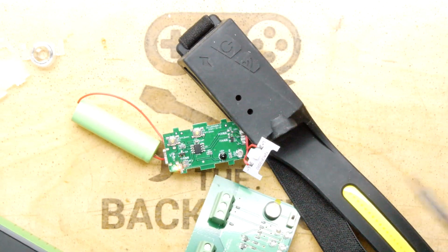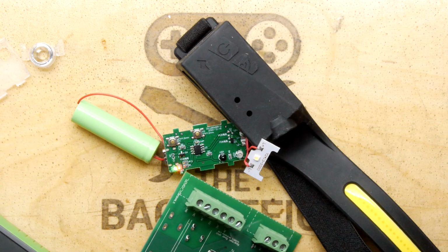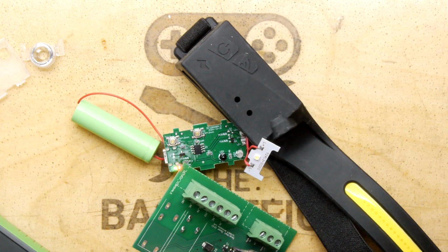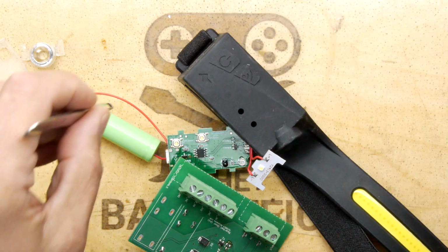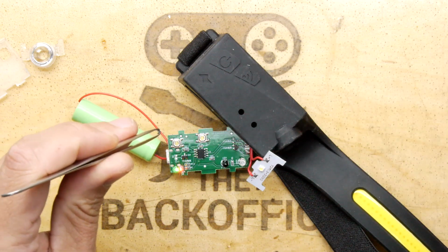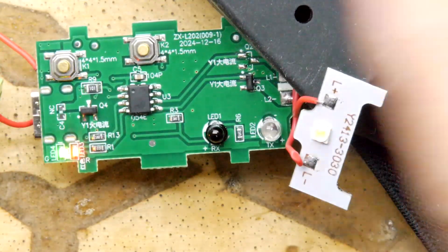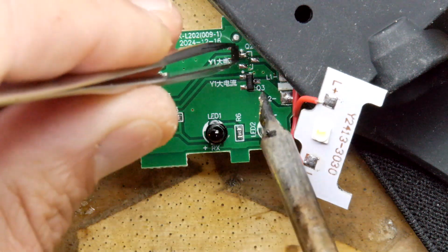So I do have this board here, which I'm serving as a donor board. It has transistors on it. Again, no idea on the specification, but hey, all things being kind of similar. I think I made this board to drive some GPIO or something of that nature. It's probably going to be fine. So I've got the new transistor in my tweezers. Zoom back in. Let's see if we can get this. Oh, okay. That hand activated mode is working fine and annoyingly.